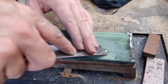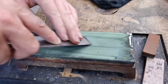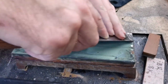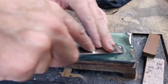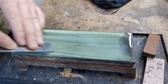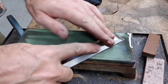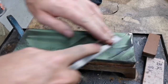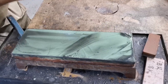This chisel is going to be amazing. I can tell by the steel, I can tell by how much it's had to be worked. This is going to be just like mine, because this is from the same set — it's going to be an amazing chisel. Take the back off again because I might have created a tiny micro bevel on the back. Take the wire edge. Wipe the back down, wipe the bevel down — and that's it.